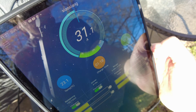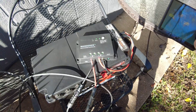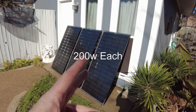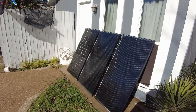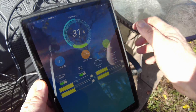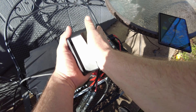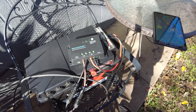We'll let that charge for a minute and see if it's getting too hot. The solar panels we're using are the Bouge RV bifacials, which pick up on both sides — we've got three of them in parallel. The Wanderer is still kicking butt at 31.4 amps and I don't feel a lot of heat coming off it. Let's move on to the next one.